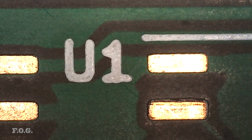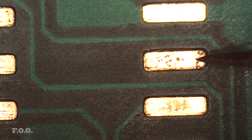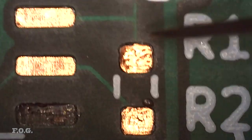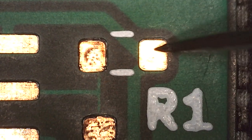The other thing that I was testing was trying to get these pads cleared using a new technique, and I purposefully even got rid of the little heat sinking legs here to make it a bit of a harder task. But the reality is the new method I used actually failed. You can see that this is all sort of puffing up here, and these small 0603 pads, I mean, they're tiny in themselves, and then they've only got a very tiny track coming off them. They're also looking pretty dubious, I would say. This one here, which has got a big fat line, looking good.